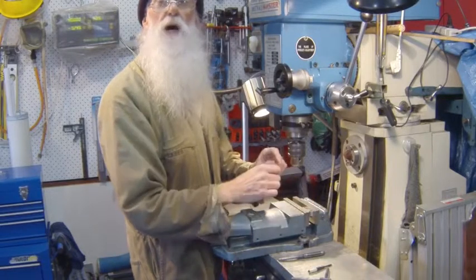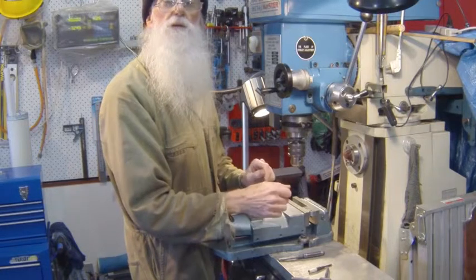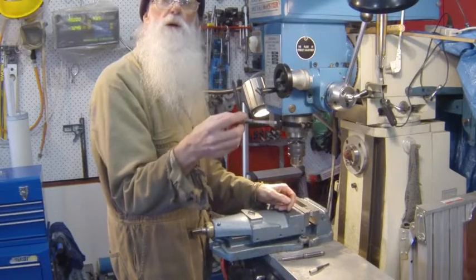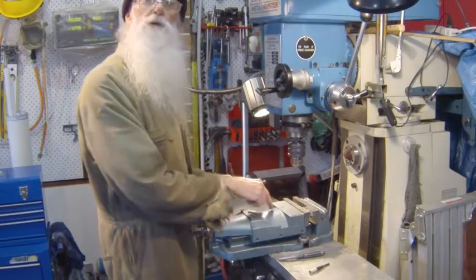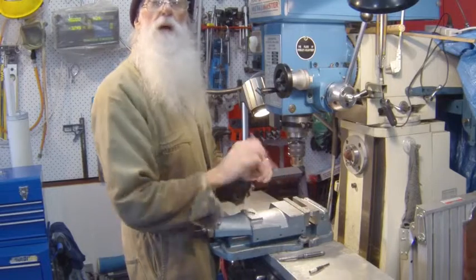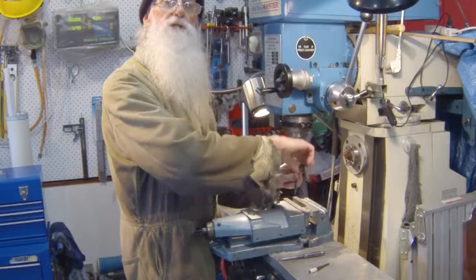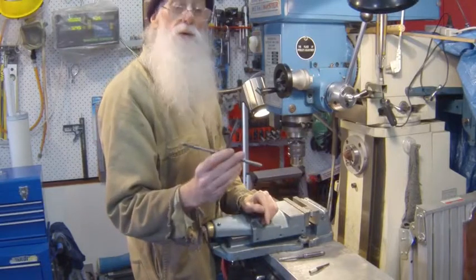And if you want a half a thou sliding fit, or 4/10 sliding fit, you can achieve it with that all the time. But I don't recommend that if you've got 5 holes to do, you ream it and say, oh yes, I've set that, that's exactly what I want, and then plunge it in. It doesn't work like that. You need to build up to it with slight cuts. So these are expanding reamers.